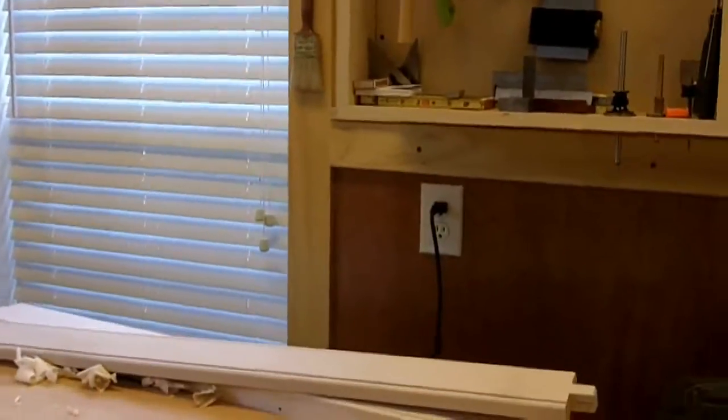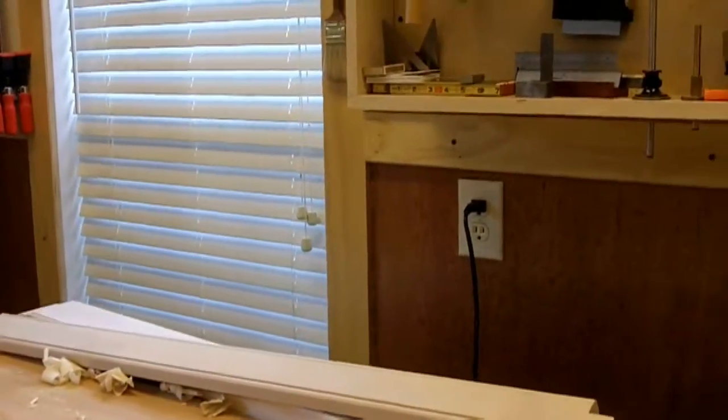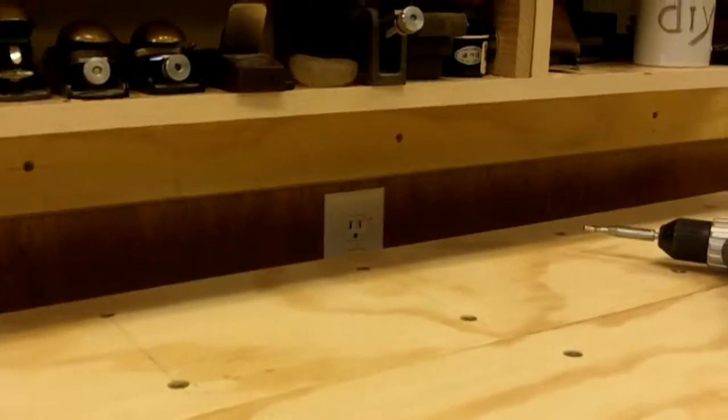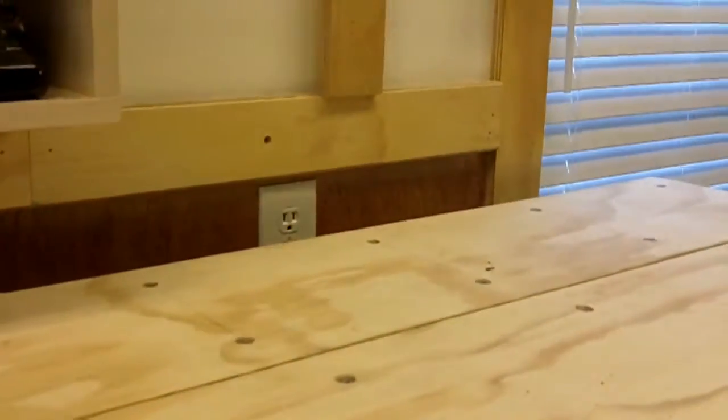Following the ceiling lights, we had to think about providing power for the workbench and the shop wall. As you can see here, I have outlets placed almost at every other stud at a height that's convenient for working with the countertop and the workbench. Now that's going to be messy work. Electricians are going to do a lot of trenching. They're going to have to drill through studs. Once he's done, you can start working on the finishing touches.